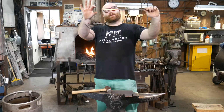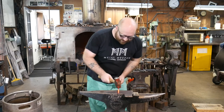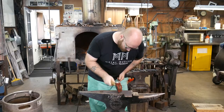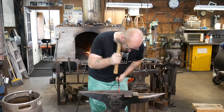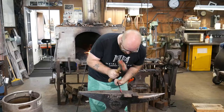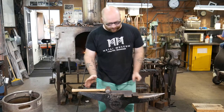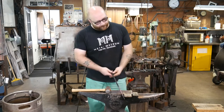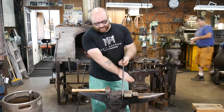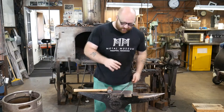So I've stretched that out a little bit more, made it a little bit longer, a little bit skinnier. But you can kind of see it's still all lumpy and square. The first thing I'm going to do is make it a little bit less lumpy by coming here onto the face of my anvil. Every part of an anvil has its own set of different jobs — the horn is great for making circles and stretching things out aggressively because of its curve, whereas the face, which is the flat part in the middle, helps make things smooth and flat. The heel of my anvil is good for doing other kinds of bends, and other tools can be added to it with the square hole.